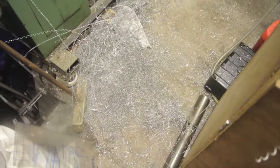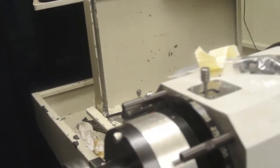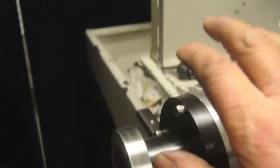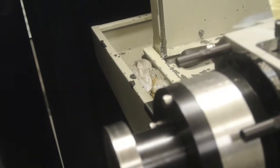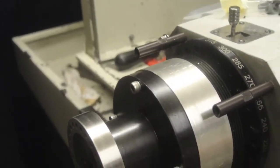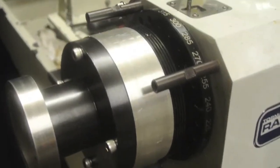I've been busy — there's rather a lot of aluminium cuttings flew off the lathe — and I'm adapting the lever collet closer to fit the rapid turn. It's the same one that fits the Slant Pro but it's a little longer and slightly larger in diameter than the draw bar supplied with the rapid turn. However it didn't take too much to turn it down to the right size so it would fit through the spindle. The idea now is I will cut it and thread it in the lathe and fit it on here, then think about guards.